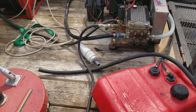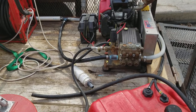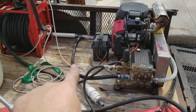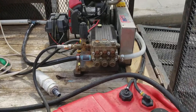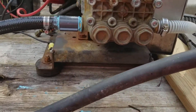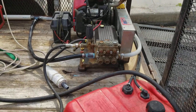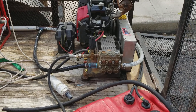Just wanted to make sure we weren't having any issues with the dual feeding system, which we shouldn't. We've got the 1-inch feed line going all the way around and a 3/4-inch tee coming off of there. Everything looks nice and dry underneath — no leaks. Put the blue thread sealer on there.